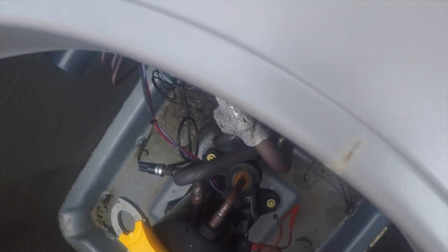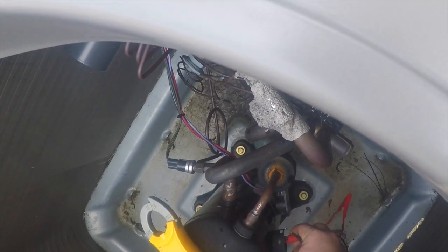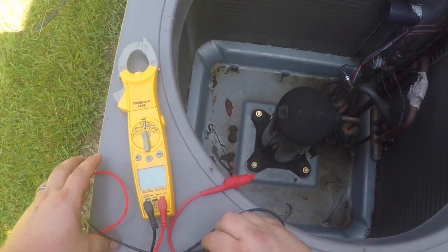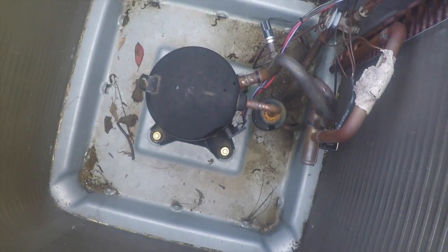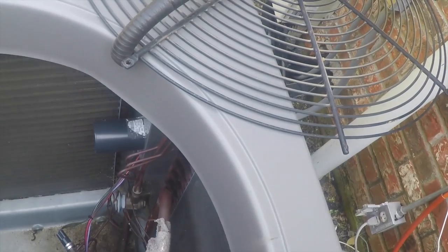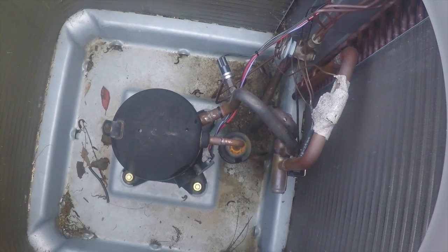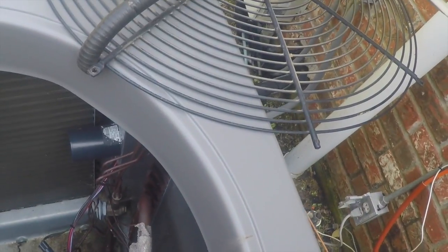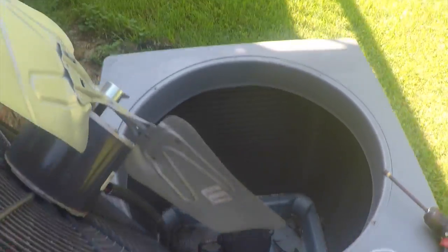The compressor doesn't seem to be grounded. I need to get a new megaohm meter. What I want to do now is leave the compressor unplugged, then go flip the breaker and see if it stays on and see if just the condenser fan motor runs. If the breaker does stay on with the compressor unplugged, then we know we have something wrong in the compressor. So I'm going to leave it unplugged, lay the fan back on top, maybe put one or two screws in it and then try the breaker again.